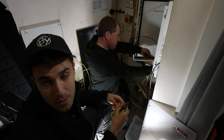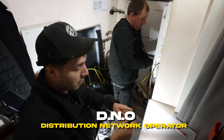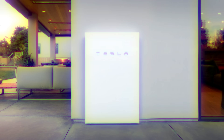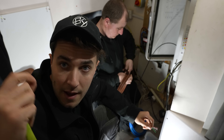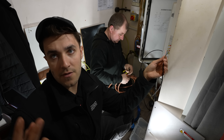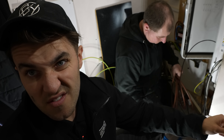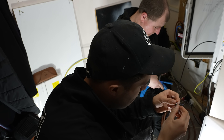With every solar install or some battery installs, you have to get the DNO involved — the distribution network operator, like National Grid, SSE, whoever it is. We had a very confusing meeting with them yesterday. We'd installed a Tesla Powerwall and applied for an export of G99 at 11 kilowatts, which is the maximum the inverter can handle, and that had been approved. But when the SSE chap came for a witness test, he said there was a four kilowatt limit. Anyway, that was a lot of hassle but they ended up backing down — it was just an admin error on their end.